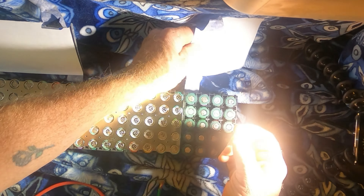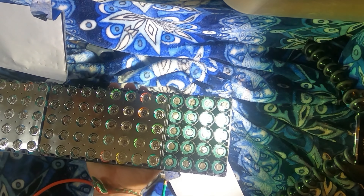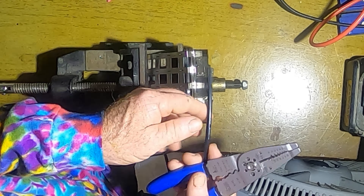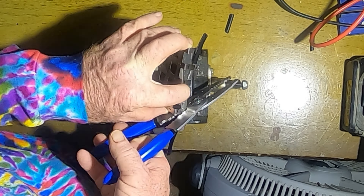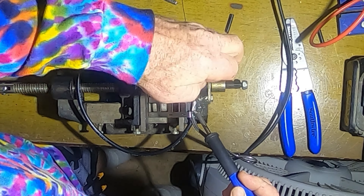They're all done except for the ends where the power goes in and out. You have to be very careful handling it because anything touching is going to melt all those pretty little fuses. Here I'm making my end terminals: I cut a piece of tabbing and leave it two extra batteries long, strip a piece of 10-gauge wire the width of the pack, fold over the extra tabbing, crimp it down, and solder it all together.